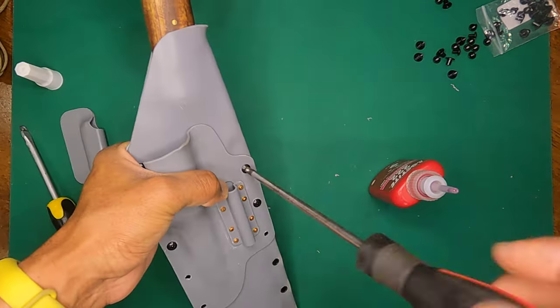I'll put this through the bottom, the spacer gives me a bit of a boost, and now I can just screw this in and I'm isolated from that curvature. Because of the thickness though, this screw is too short. Thankfully I have longer screws. There we go — now I'm catching threads properly.